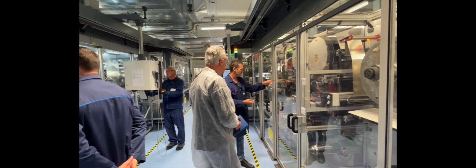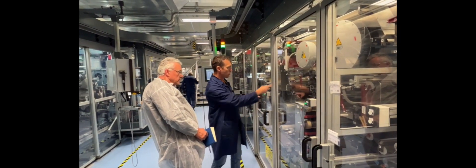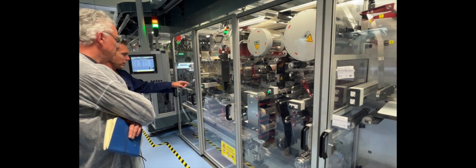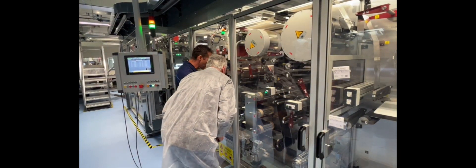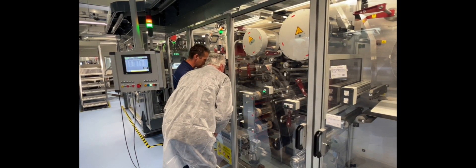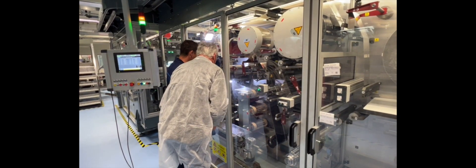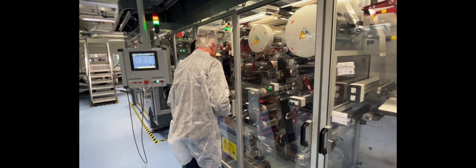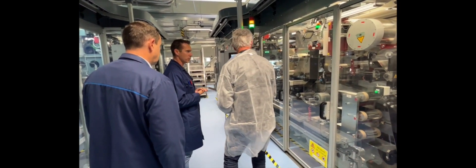So we complex the cathode electrolyte coil and the lithium coil. We complex them here — we have two cylinders running. So you have the lithium and the complex together. You see we have the complex: the current collector is gray, the black is the cathode and electrolyte, and the lithium. And you have one layer of electrical cells. After, we're stacking around 50 layers of cathode, electrolyte, and anode.